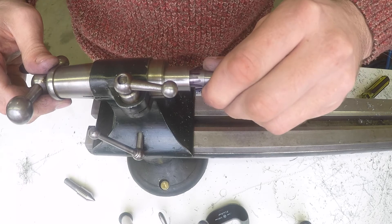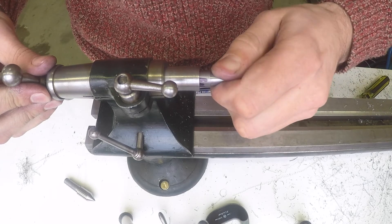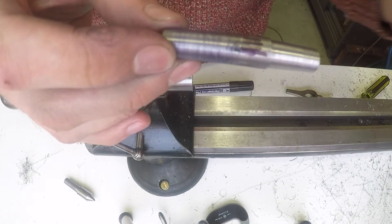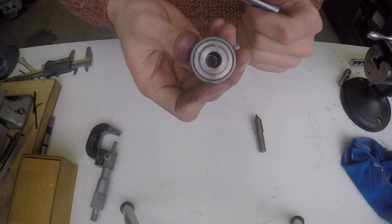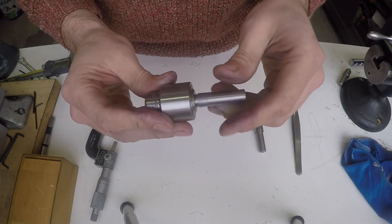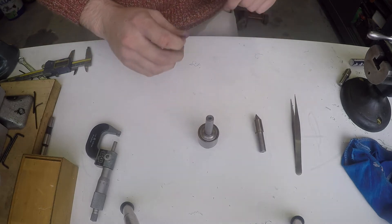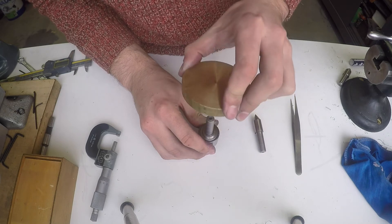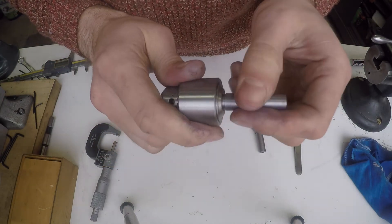Yeah, that's going to be nice — it's starting to grip there. Wind it in just lightly. Yeah, that's really going to stick in there. Really nice — really happy with that one. So now it's time to take our freshly turned taper and to seat it into the drill chuck arbor. That can go into the drill arbor there, and I'll just give that a light tap with a piece of brass. And that should now be in there permanently.